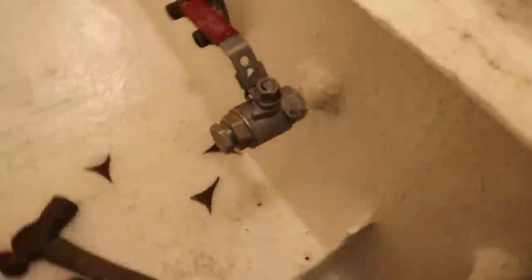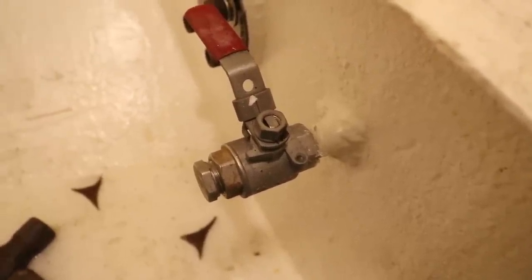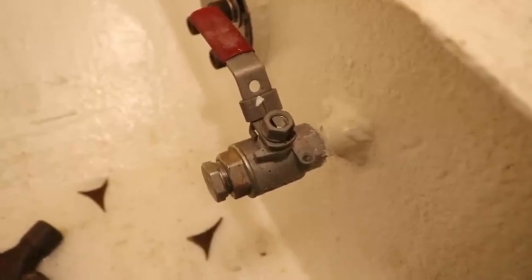Okay, so the two areas where it's going to leak is right on the bottom of that plate. I can't see anything coming out. Having a bit of a look all the way around. Can't see any bubbling anywhere. It's all going to come out this bottom edge here, if anything. I can't see anything. The next spot is, I know I welded that ball valve up on the inside, so theoretically that ball valve, I could take it off and it's okay.